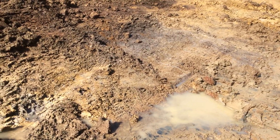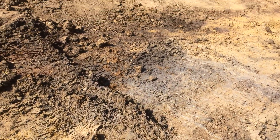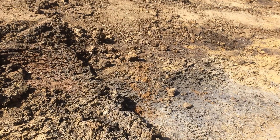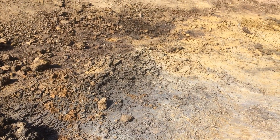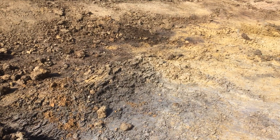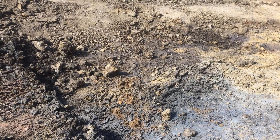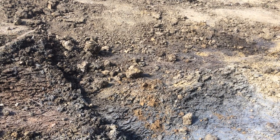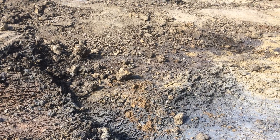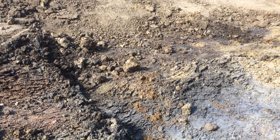What's very interesting is that it's spring-fed and it's making water. But if we look over here, we've got a topsoil seam, and that was the height that it was holding water. The water is moving through that seam of topsoil. When they built the dam, they basically just pushed a hole — and that's the importance of putting the key in and getting rid of all the topsoil, then putting in your clay and track-rolling it down.